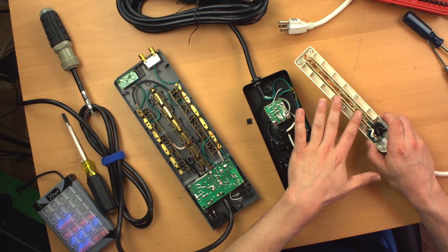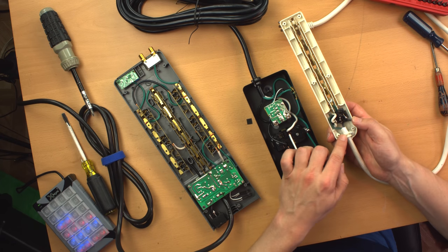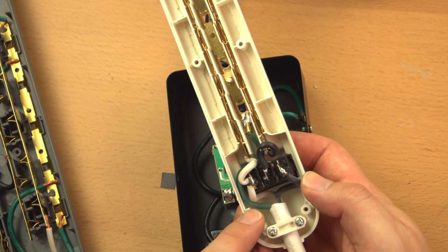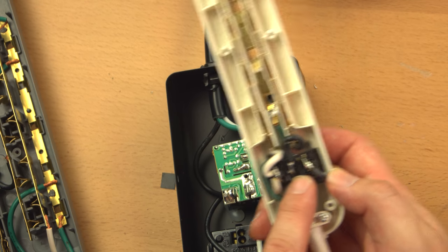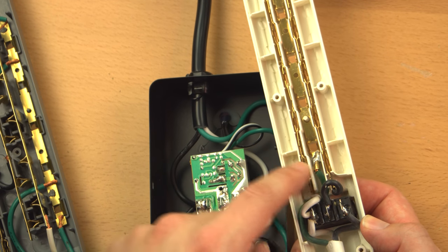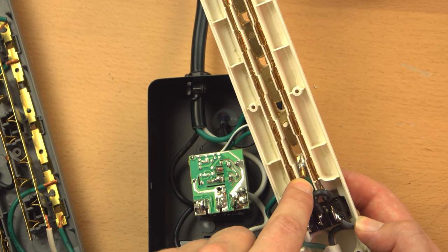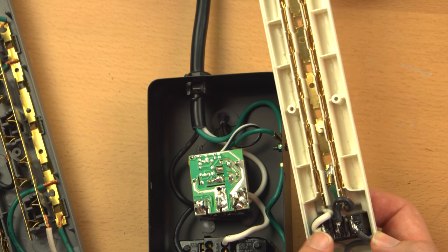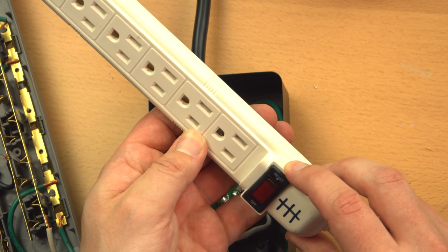All right, so here we are, and I guess you can kind of see where the cost difference is, at least as far as complexity goes. This is obviously the cheapest of the power strips, and it really just consists of the incoming wires, let me get in close there, coming through this cable. The hot or live leg comes out into the switch slash circuit breaker, and then continues on to this bus bar on this side. Then the grounding wire comes in, goes straight to this bus bar in the middle with a big blob of solder on there, and goes all the way up to the other end. And then same with the neutral, only the neutral hits the switch first, which I think is just to light the front of it, which is probably...